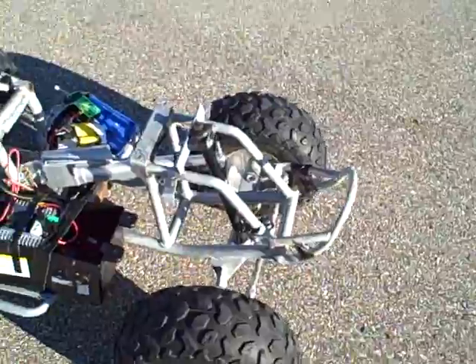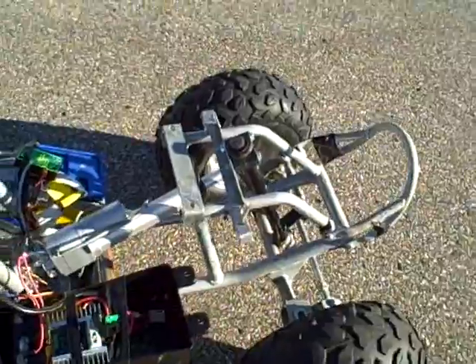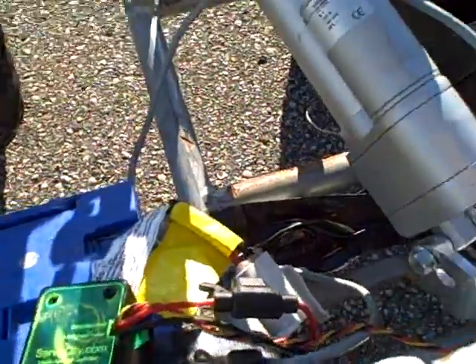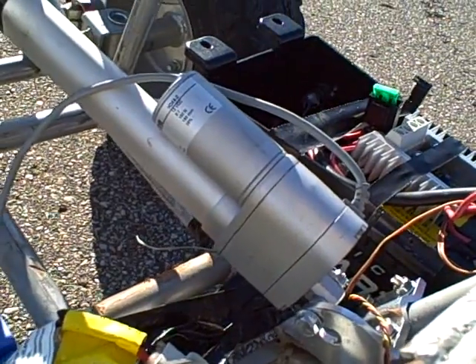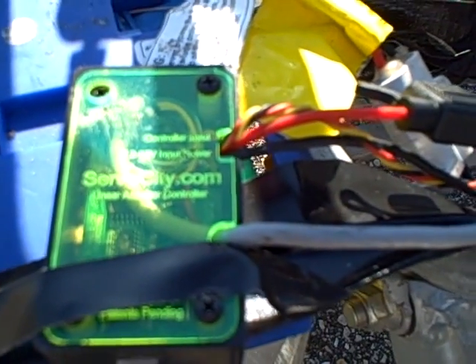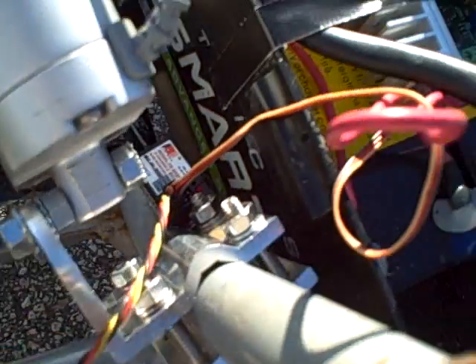As you all know, there are several different ways to control the steering. I chose to pony up a couple bucks and I got the ServoCity - it's a 12-volt, six inches of travel linear servo. Some of them are actuators, but the ones that have feedback, they told me at ServoCity, are actually considered a servo. There's a little box that goes with it, hooks to 12 volts - that's what that battery's for.